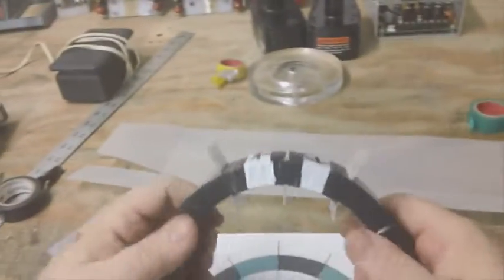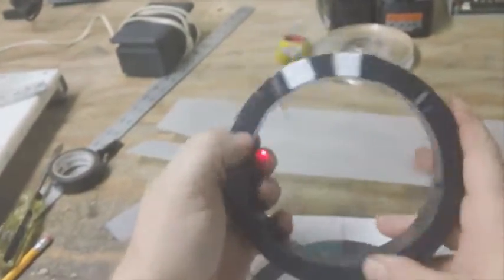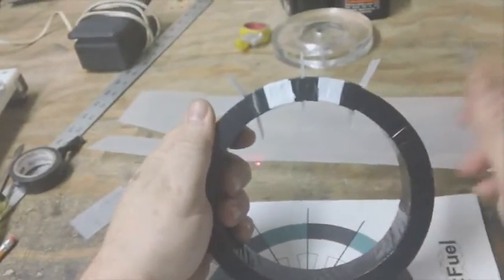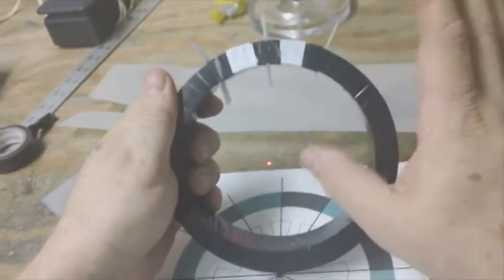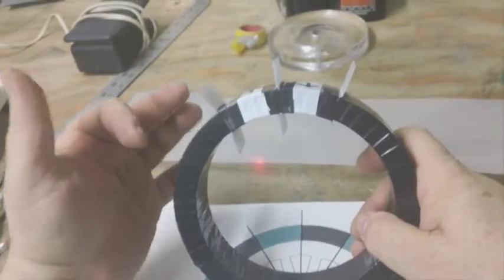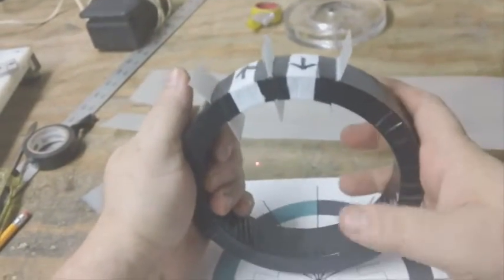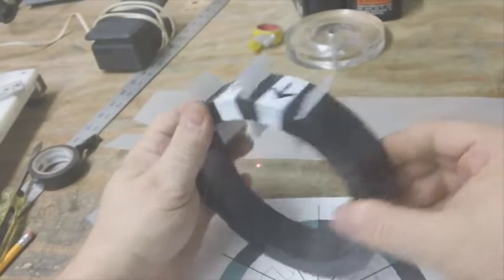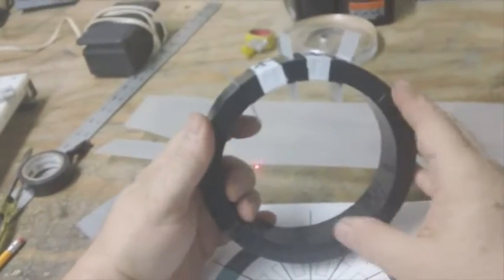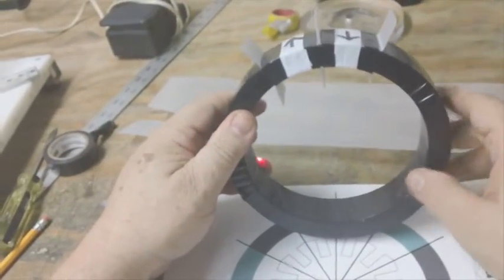I have to redo that a little bit and make it smaller to fix it. But basically this right here is really pretty simple — I just tape it using that same material. We're going to use met glass for this. I'm waiting for a shipment of met glass from one of the forum members — G47 took on the task of arranging the shipment of met glass we needed to build these next-generation stators that will be two inches thick. So I'm waiting on that, and this is to test how well it works using the alternator type.